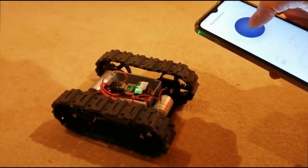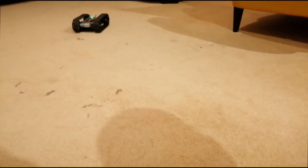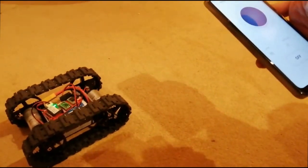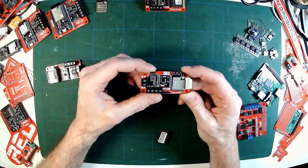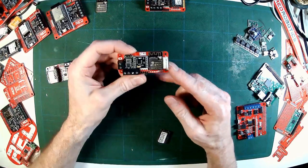The first board was made using components I already had, so I started looking for cheaper alternatives. Here's the next board with a cheaper H-bridge and DC-DC converter from AliExpress. It still uses the M5 Stamp Pico, but I realised this is too expensive — it's about $6 for a component that's supposed to fit in a $10 total budget. So I designed another board with the same H-bridge and DC-DC converter, but instead of the M5 Stamp Pico, it's got an ESP32-S module like this.